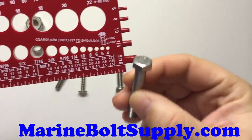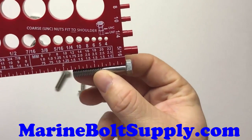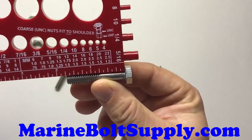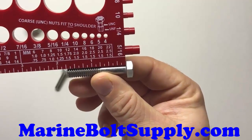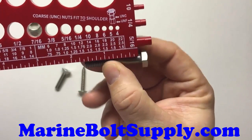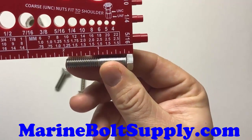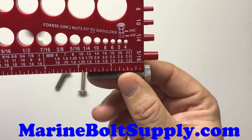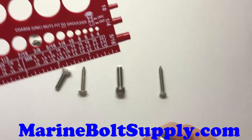As I said before, if you have a bolt with a head on it, you don't include the head in the length. By putting the head above where the rule starts, you can see that this bolt is 1-3/4 inches long. If you didn't know that and included the head, you would end up ordering a 2-inch bolt, then realizing when it comes in that it's too long — and that could cost you money and time. Knowing how to do this is important.